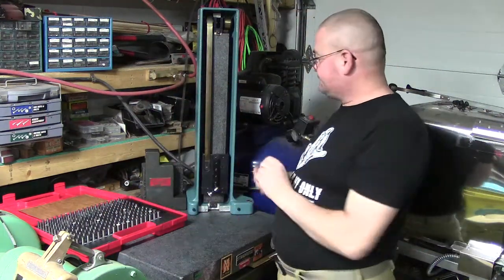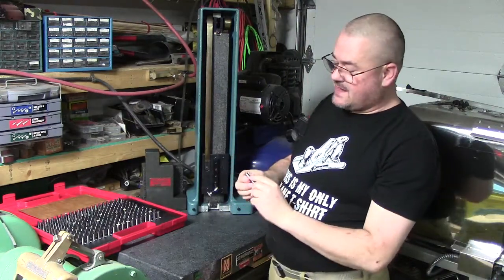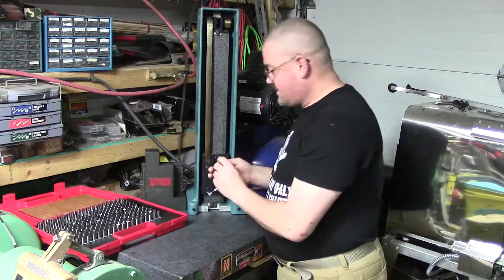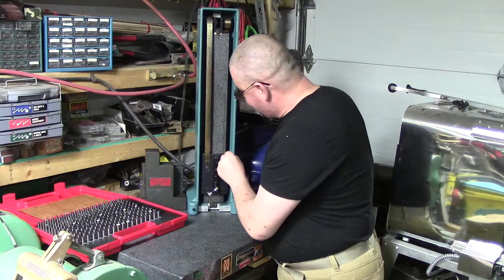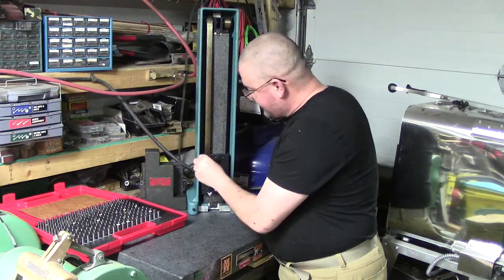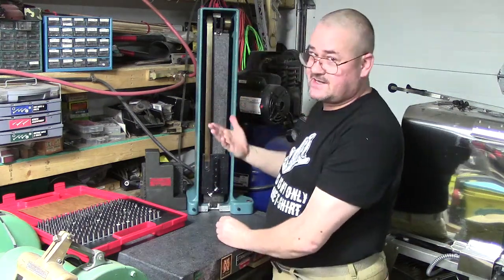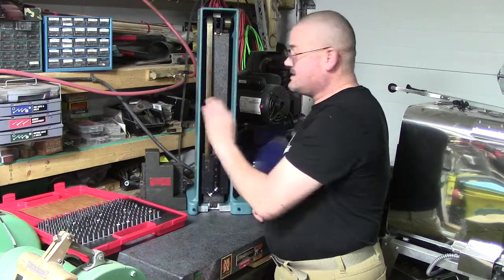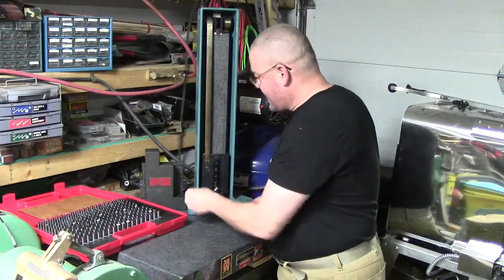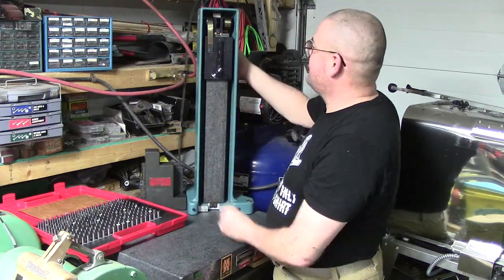What I ended up finding the size that worked was the 410 thousandths pin. I've cleaned it off now, but I actually made a little mark with a blackout or Sharpie marker. Went in there and figured out, okay, ½ inch in, and just measured and got my distance down between. Now there's some imperfections on the inside of the case, so sliding it doesn't necessarily mean it's a good thing. At the top and the bottom here, I went in the ½ inch, wiggled it, got that one around, kind of snugged it up, and then I did the same thing up here.